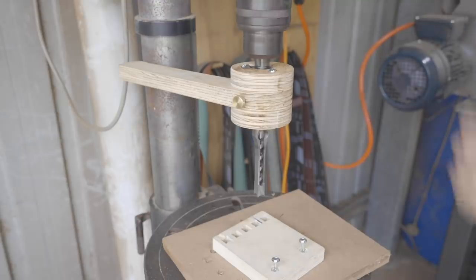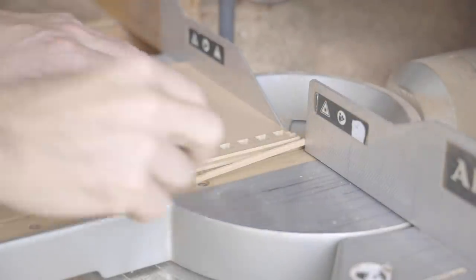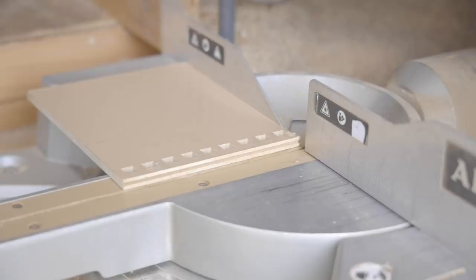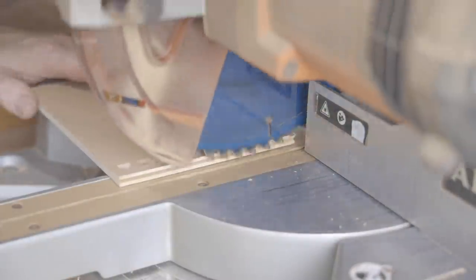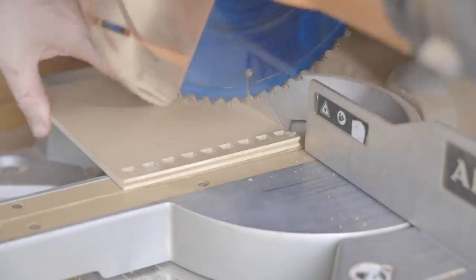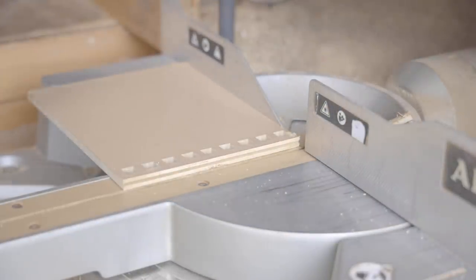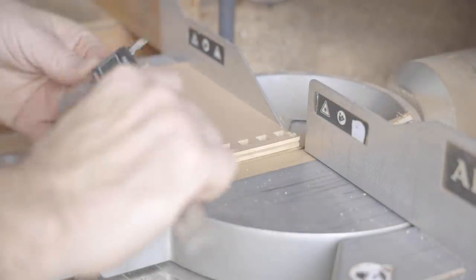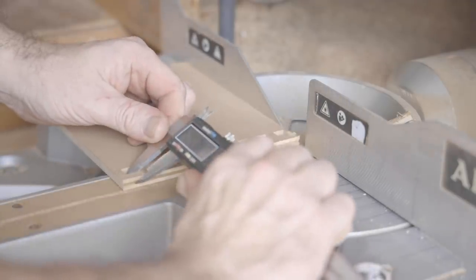Here I'm trimming down the template. I need the outside edge to be a quarter of an inch and it needs to be quite precise. To do that I'm cutting a little off at a time — I'm pushing the workpiece into the blade while it's not spinning, flexing the blade, holding firmly onto the template, and then when the blade lifts up the template stays where it is. I make the cut and it takes off just a tiny sliver. This method works really well when you want to take just the tiniest amount off something.